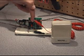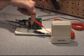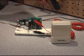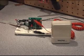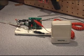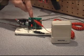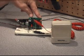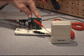You notice the LED's on while it's sending the code, and then it turns off afterwards. That's to unkey the transmitter that it simulates. Yeah, it'd be very easy to interface that with your radio. It would be, yeah. And so here you go. A repeater controller for roughly $30. A repeater IDer. You might want to adjust your timing so it didn't ID every 15 seconds.